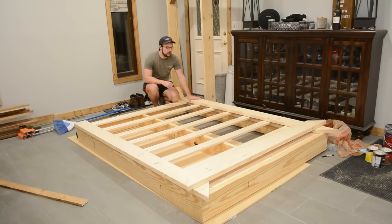I just finished cutting the 2x6 perimeter that'll serve as a ledge around the mattress. I can't install those yet because I need to go underneath the slats to do so. I'm going to move everything into the bedroom to make sure the smaller box isn't visible beneath the larger box — that's the whole floating bed effect. When it's in place I can get underneath and screw in the perimeter, check the miters, then unscrew it, sand and stain everything, and reinstall.